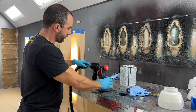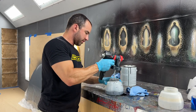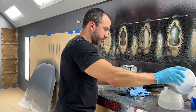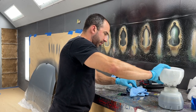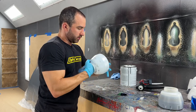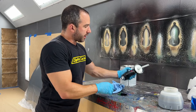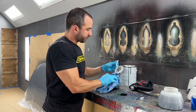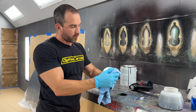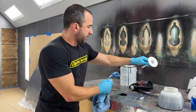Put the top half of the gun right back on — this is really going to do quite a bit of the work for us — and shake it up really well. You want the naphtha to get into all the nooks and crannies and coat the inside of the paint cup. Then, in a well-ventilated area, spray that half quart of naphtha through the gun. Try to spray all the way through it, then take the paint cup back off, pull the trigger to get any extra naphtha out. You can already see the gun is much cleaner. Pour out the naphtha, and put your microfiber towel to work — wipe off the threads on the paint cup, get the microfiber inside, and wipe out the interior. Any leftover dip will get picked up. Let it air dry.